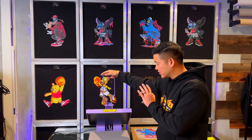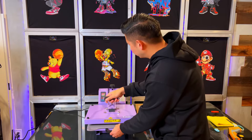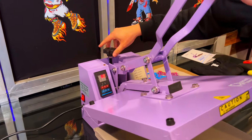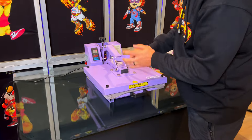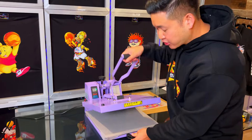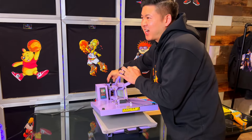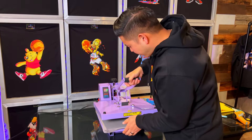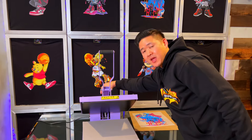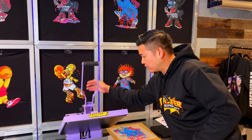We're going to go ahead and adjust the pressure. This is defaulted stock out of the box so of course they didn't tighten it yet. I did a first quick press and it was very easy on the handle, so I definitely want to crank it up. Righty tighty — as I'm tightening this you can see it adjusts slightly and changes the angle. I'll screw it as tight as possible and then adjust from there. One thing to note: the knob is a little loose so it may move during adjustment or usage, so make sure you adjust it if needed.